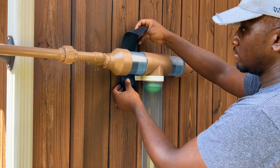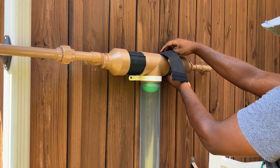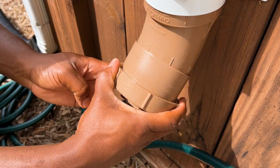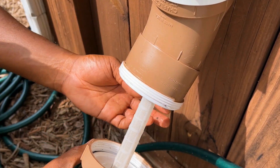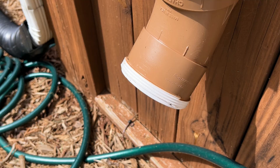After testing everything and seeing the system work properly, I decided to finalize my installation by reinstalling the HVAC wraps. When it comes to winterization, all I need to do is remove the bottom screw cap to prevent the first flush chamber from collecting water so the pipe and other PVC components are not fractured during a hard freeze.